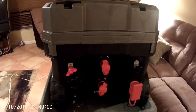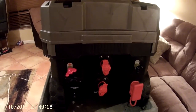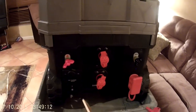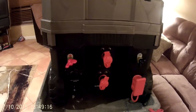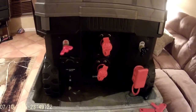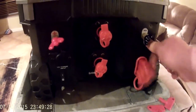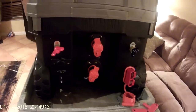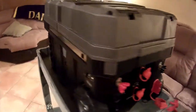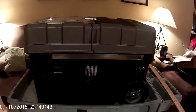It's modified sine wave but I've got a filter that helps clean it up a little bit. There's a throw switch for those auxiliary ports. I've got a 12-volt socket right there for plugging into a cigarette lighter to charge while going down the road, and I have an Anderson connector so I can expand this out to a bigger battery bank. There's a throw switch using these keys for that.